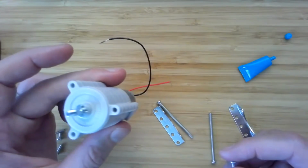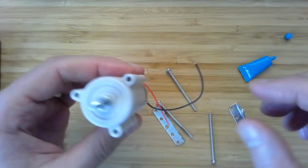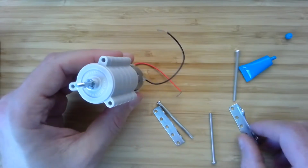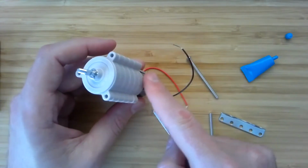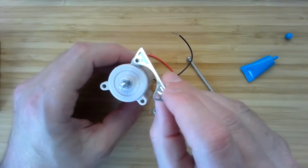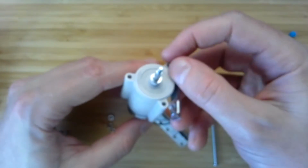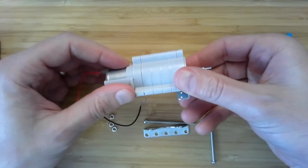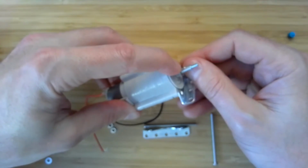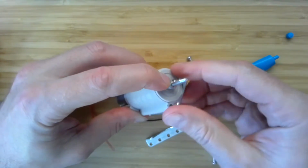And we are going to take a look at this, and it's best to put the footer such that the tab of the motor doesn't stick out to the bottom. So since the motor clips are on those sides, this is going to be the side where we put the feet. Place this front footer facing backwards, because otherwise having it sticking to the front can interfere with your capstan. If that makes sense. So keep that facing backwards.